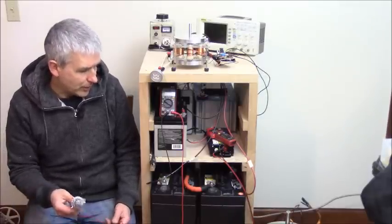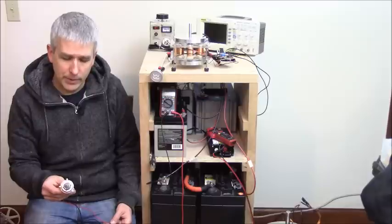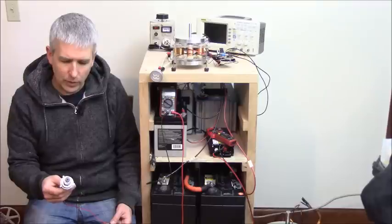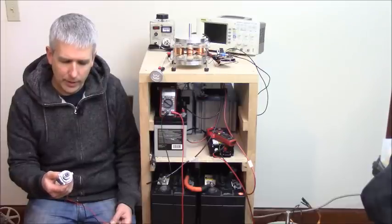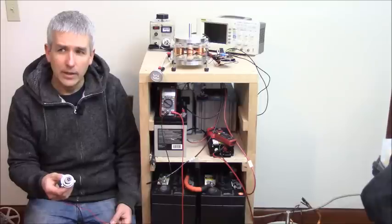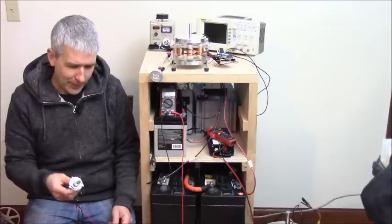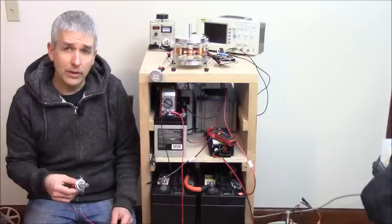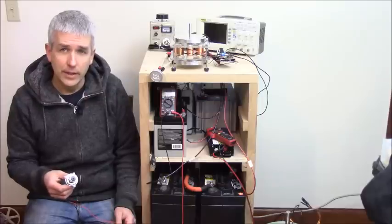So one way to discharge a battery bank down to monitor it is to have a bulb. So here's a halogen bulb, so it can put a good 5 amps of load on it. You could also hook up the bright lights on there. It may get too hot though if you do both of them at the same time, because that's not really how your car runs, I believe. I should know as a mechanic. Anyway, if you have the bulb and you just keep discharging the battery till the light goes out, then you know you don't need to discharge it any further. That's as far as you go.